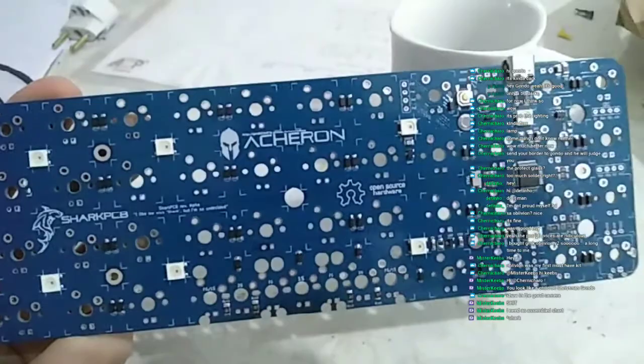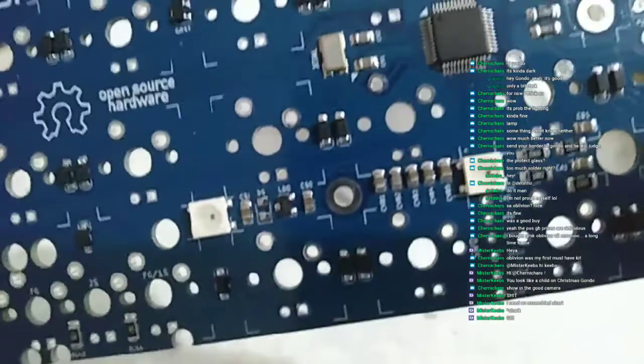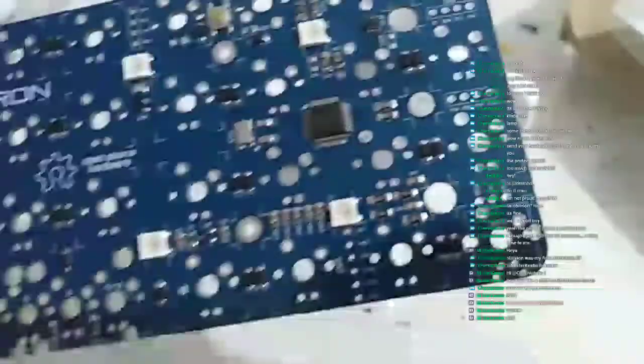There are little modifications that will take part, like these bypass capacitors here. They will be closer to the microprocessor, as they should be. I really did goof on these bypass capacitors. They should be closer to the MCU, as they will be in the final version. But there are some modifications in the encoder nets, but just on the nets, the position would be the same. But yeah, this is the final Shark version. And here is the LED MOSFET driver.